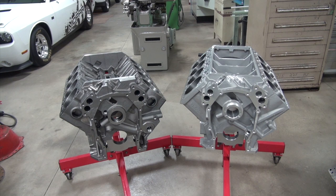Whereas on the Keith Black, it doesn't even have a provision for an internal pickup, so you will be running external lines to a pump. Any of the pumps and lines that have been popular for the last 50 years — easiest one is a stock pump with a top plate that has a fitting for the oil line. But that is why I like this. There's nothing wrong with this either; this is a nice block, very beautiful casting. Seems like all the castings today are really nice — they've come a long way.